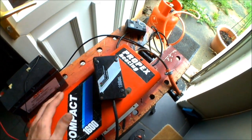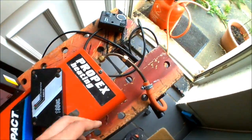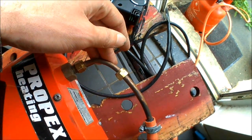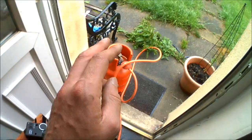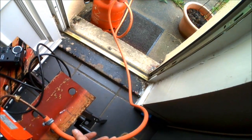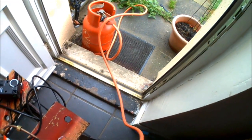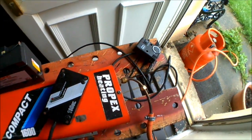Very simple, very easy basic units for fitting. You've just got your one gas pipe — your gas pipe should be running off copper pipe all the way through to the bottle itself, or at least to a junction pipe for the bottle. You don't really want to be relying on flexi hose; this is just here for demonstration while it's not fitted in the van.